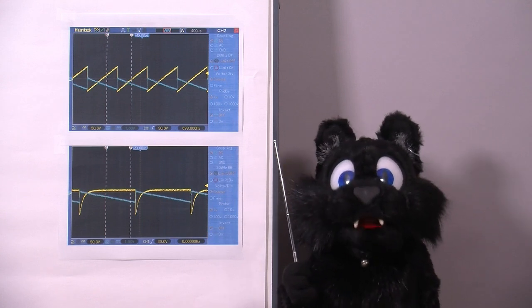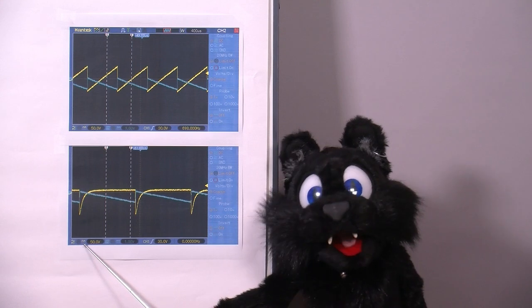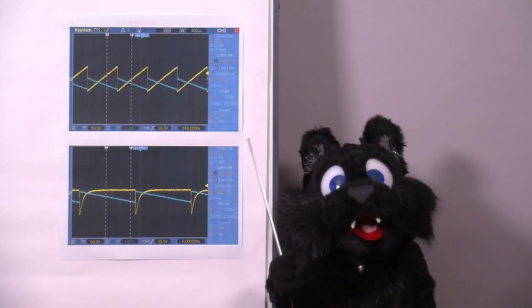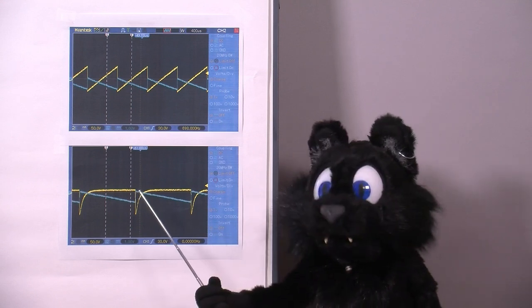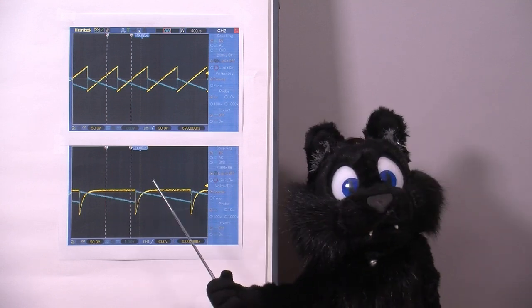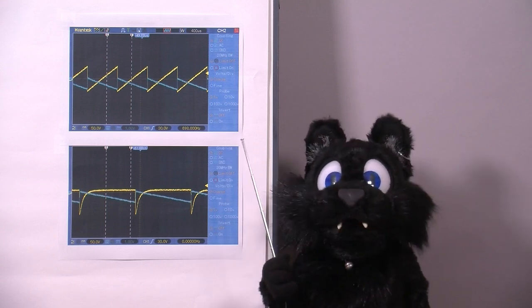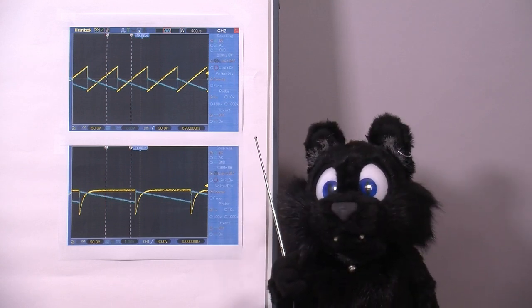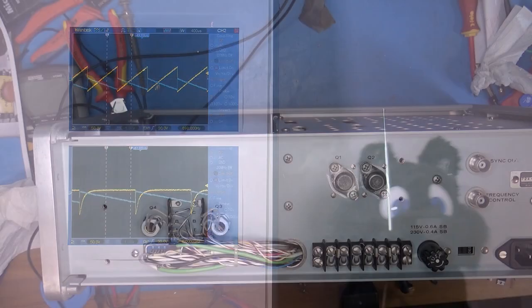I didn't realize I had the channel set to AC coupling, and the low frequencies are really low in this case. So what I saw was a high-pass filtered version of the real signal. Switching to DC coupling, it works perfectly fine. Oh! Excuse me while I fix the forehead-shaped dent in my desk.